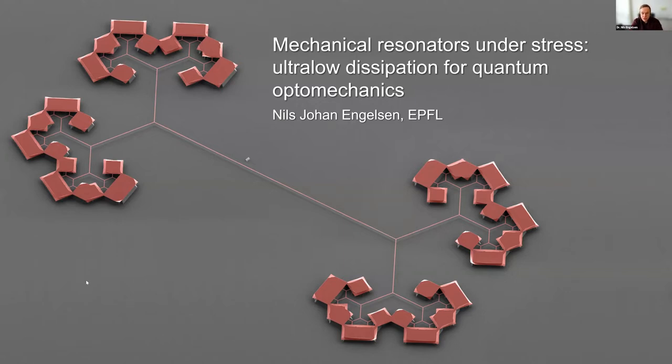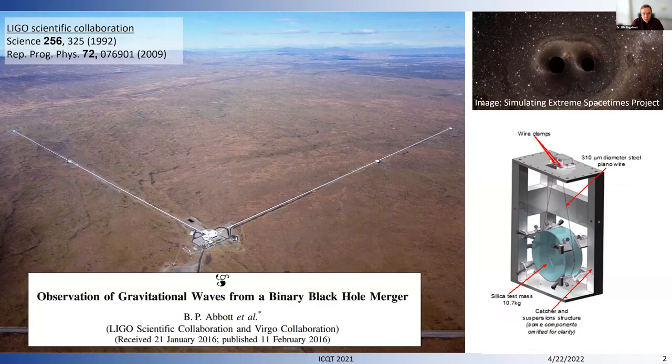This resonator is roughly a millimeter scale on the central segment and consists of 20 nanometers thick suspended silicon nitride, which is a high-stress glass particularly suitable for nanomechanical resonators. In the rest of my talk I will explain how this geometry is especially suitable for engineering high Q, and why high Q is important, and also show a range of other designs that are compatible with extremely high quality factors.